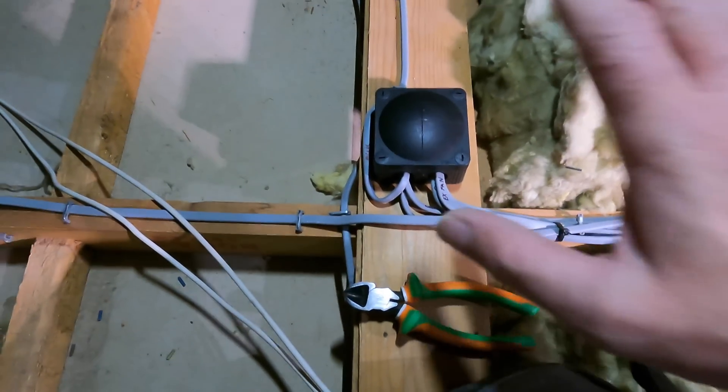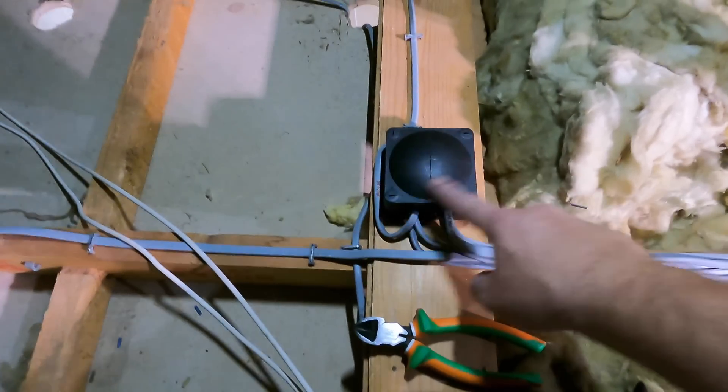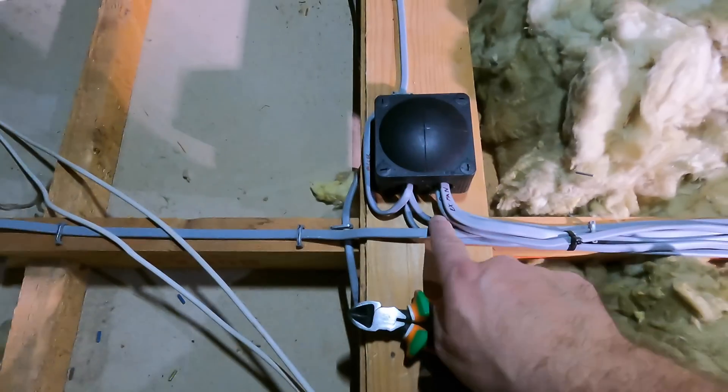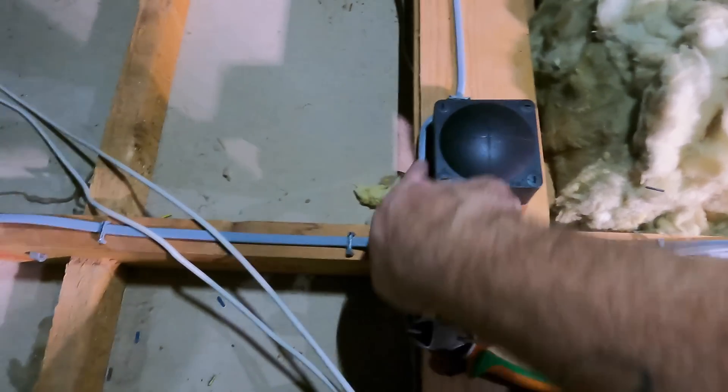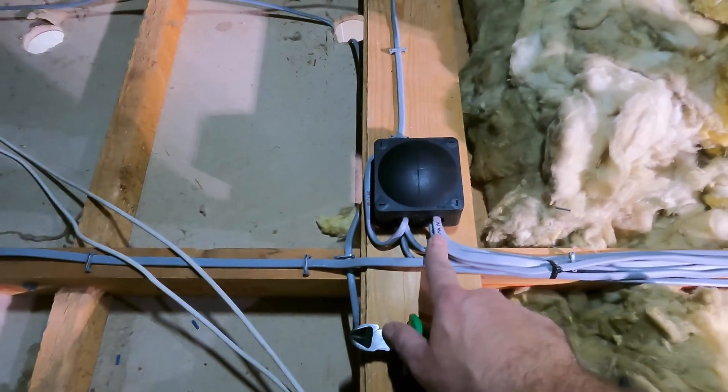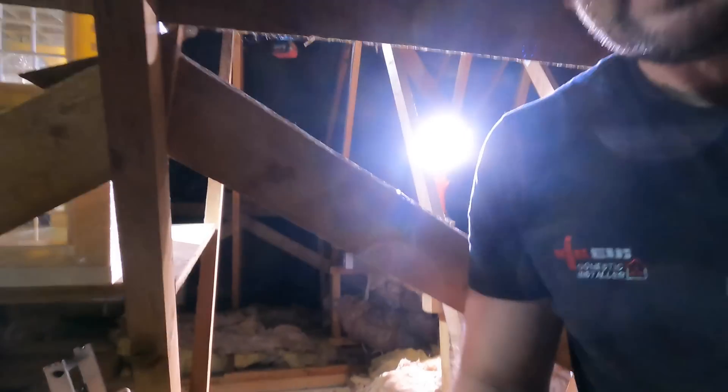As you've seen there, a lot of cables to get into that space, but I find this is the best way of doing it. I always label up: extractor fan, downlight, switch live - these are all my loops - and then this one here is off to the mirror. So a little bit more tidying up to do, but you get the gist. That will also help you if there's any sort of fault finding, because this house has had some rodent damage, so it's easy to trace. Also it takes seconds just to write on. It might not be me, it might be a new owner getting another sparky in. Another sparky will come in and go, yeah, that lad's done me a solid there, wrote on everything what it is. As long as you write it in the right order.